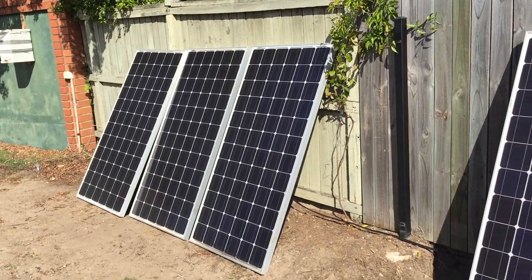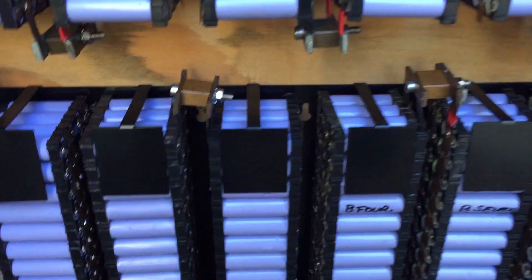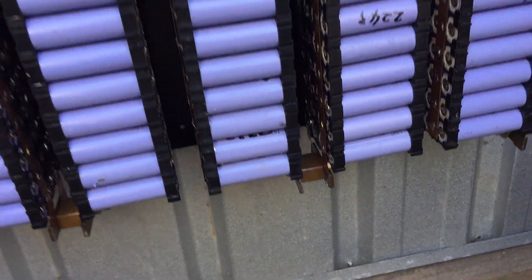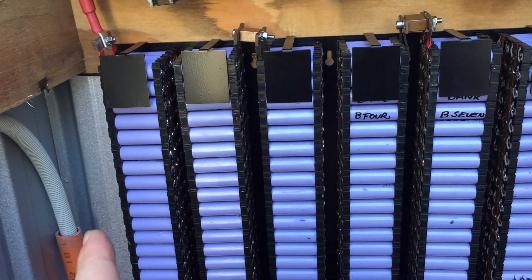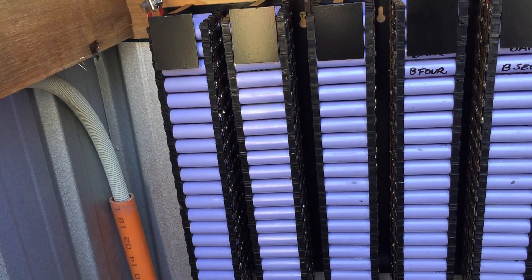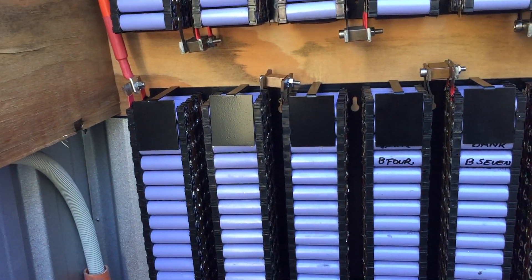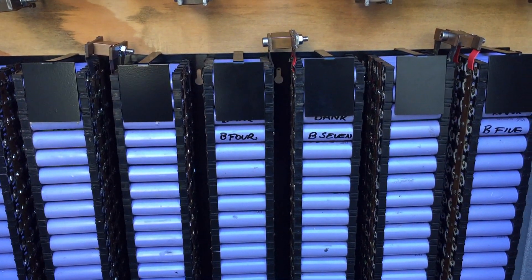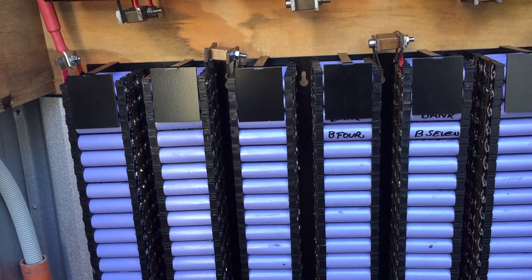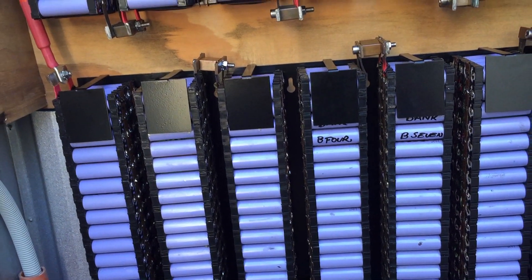It's ramped right down now because we're fully charged — been fully charged for about an hour. I've also completed doing the last pack. It's like a reassignment — I put the bus bars at the bottom. If anybody's interested how long that took: it took about nine hours to pull them apart, clean all the bus bars, reuse them, stick them back down, let the glue go off, and then solder them all up. That includes all the waiting time for the soldering iron to come back up to temperature.